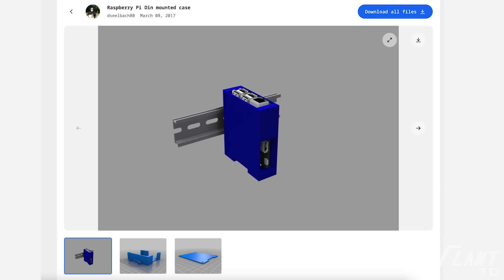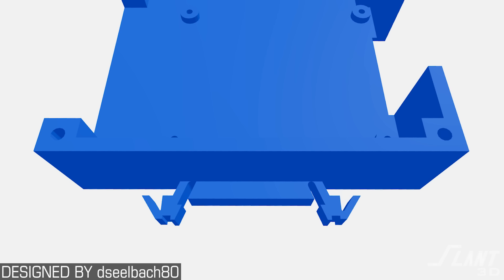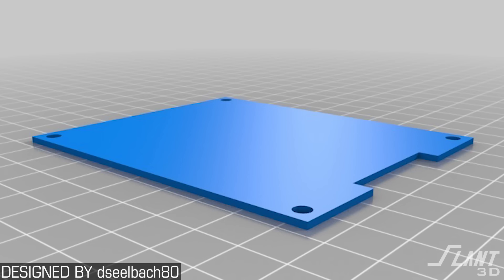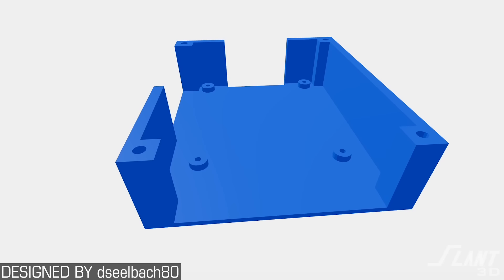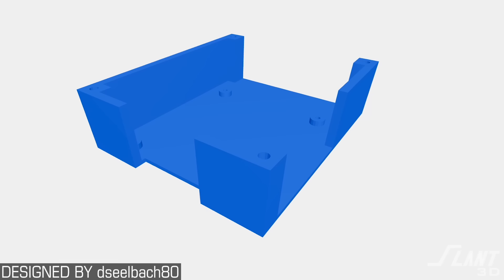Next one: Raspberry Pi DIN Mounted Case. This is an interesting application because the value of 3D printing is that you're able to make very accessorized types of products — able to produce something for a particular application, in this case mounting up to a DIN bar. Having those fixtures and interfaces are really useful because you can integrate them straight into the part rather than screwing them onto the side. This part is kind of not ideal for production because the top cover of the enclosure is a flat piece and you don't want that. You'd want to print it on its edge. The individual standoffs the way it's printed right now are not very ejectable, and those individual islands are somewhat brittle. But it's an enclosure mounted on a wall — it doesn't have to be super strong, but it could be optimized a bit.